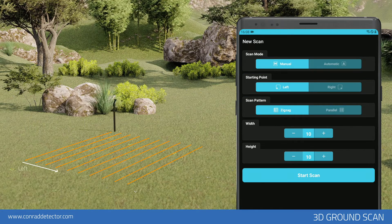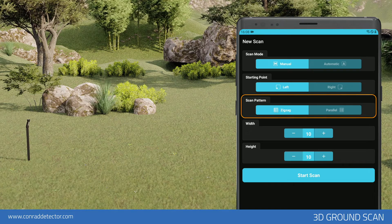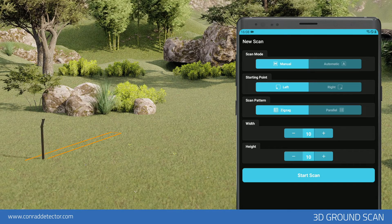If you start searching from the lower left corner, you should proceed to the next scan job on your right. If you select from the bottom right corner, you should proceed to the next scan job on your left. You can do your scans in zig-zag or parallel. In zig-zag scanning, you can scan the sequences back and forth. In parallel scanning, the starting point of each line should be right next to the starting point of the previous line and in the same direction. When the number of signal pulses entered for each row is complete, you must proceed to the next series of scans. The direction of the measurement device should not be rotated when you move to the next row.